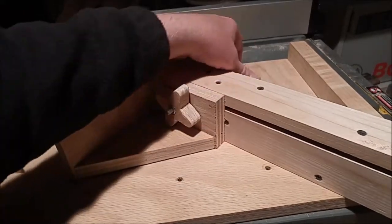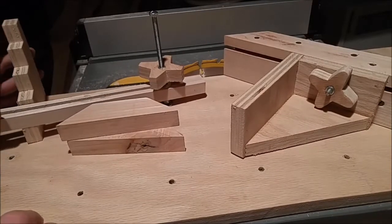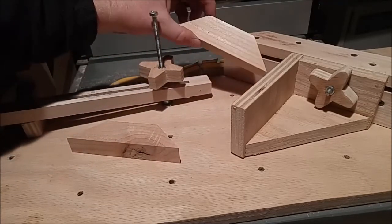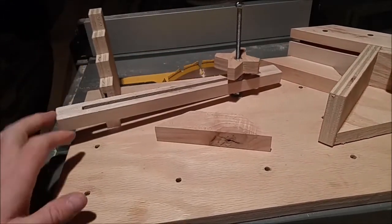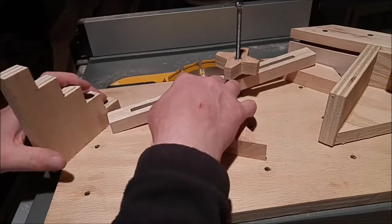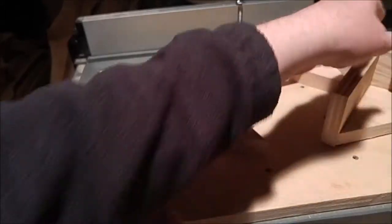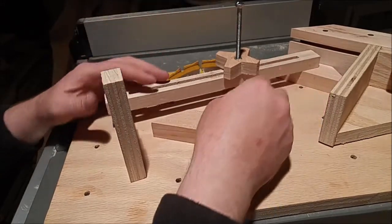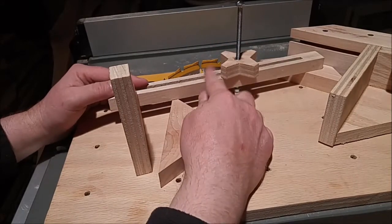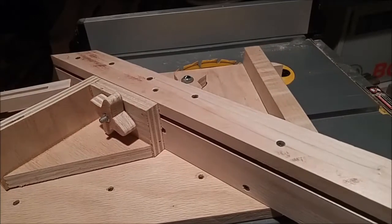It's a pretty small jig and it seems to be working really well. There's another feature to show: this hold-down, where you place your work piece here and use it to lock the work piece in place so you don't have to hold it by hand. If you have a really long work piece you can just hold it with your hands, but with something small your hands are going to get close to the blade. So you can just lock this down by tightening the nut knob. There are more details about this hold-down feature in the crosscut sled video on my channel.